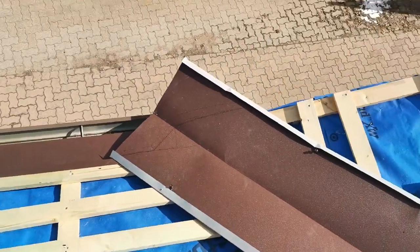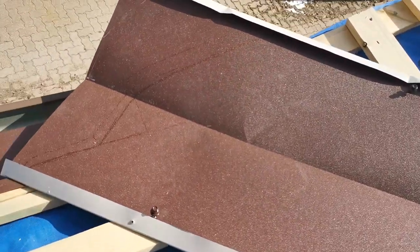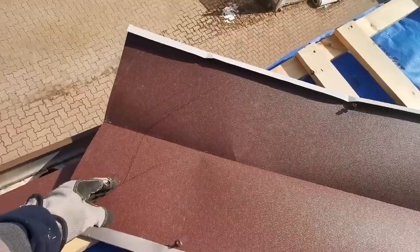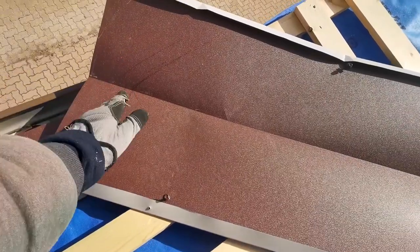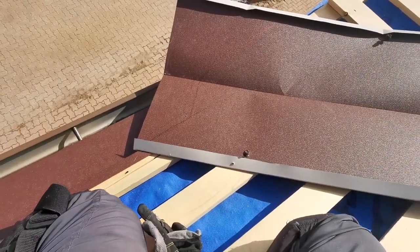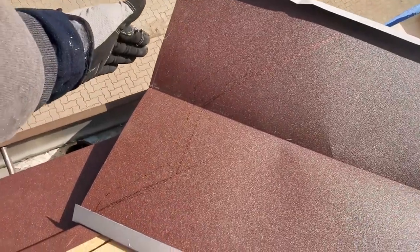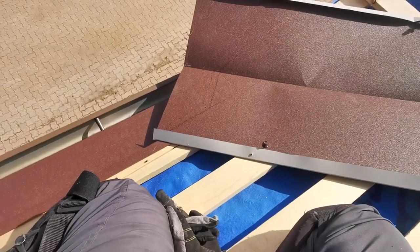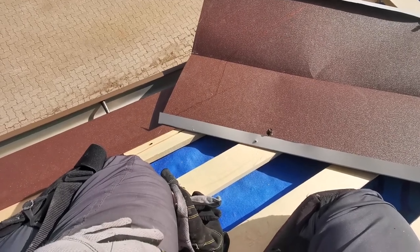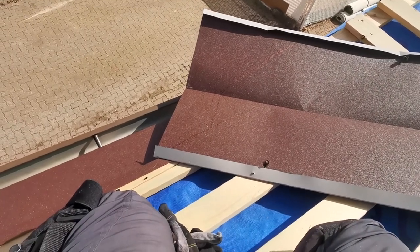So what we're going to do is create a diverter like right here. This part will go down here. Again, we're going to create a small bridge, and then the very important part would be for the gutter guys to install a diverter on the gutters, otherwise there is a good chance that water will be shooting down. So we will need to talk to the gutter guys since this gutter is going to be replaced anyway.